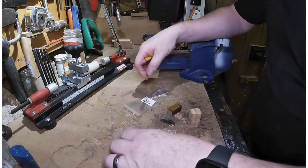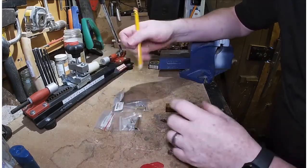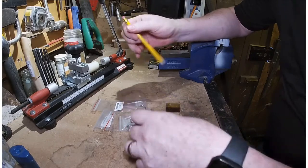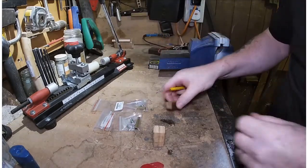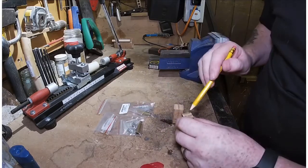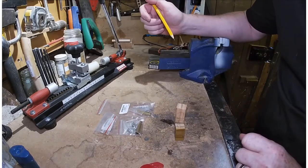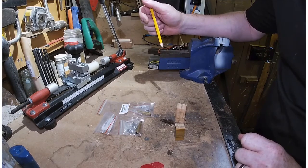I do think that that's going to make a rather beautiful looking light pull. So in exactly the same way as a pen is made, we need to find the centre, drill a 7mm hole through the centre of both of these pieces, and then glue the tube into that, put it on the mandrel and turn to the shape that you require.